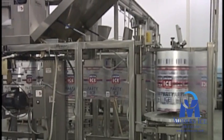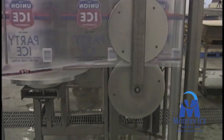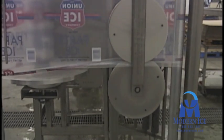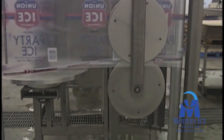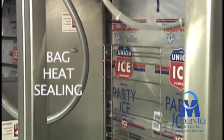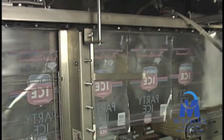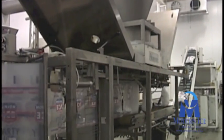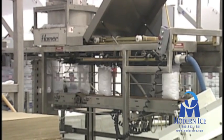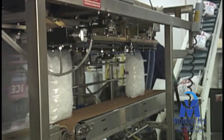This equipment utilizes pre-printed bag roll stock which is converted into a bag by the machine. The bag gusset is actually formed by a special mechanism mounted just after the roll stock mount. The bag is created through a heat sealing process. The size of the roll stock can be changed when other weight packages need to be filled. The roll stock is pulled down the line and filled by the volumetric filling system then sent on to be closed by the included heat sealing unit.